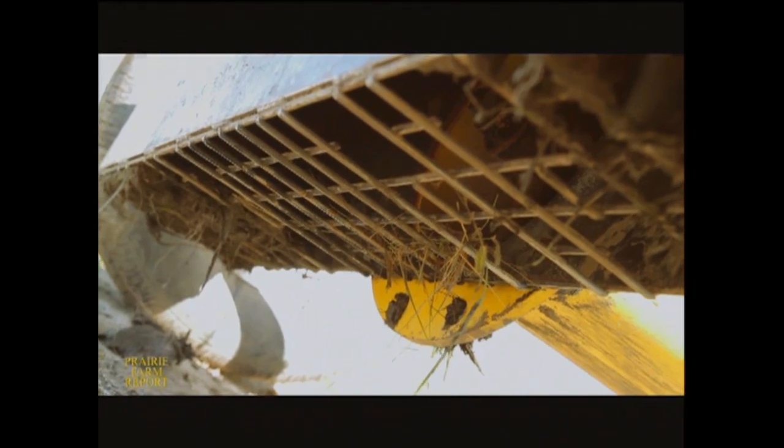The mesh underneath the bottom feeder acts as an important safety feature. It has the capability of passing at least four-inch solids, so most of the time grass and some stocks and those sort of things will pass through there. But if you back into a bunch of weeds and knock them over and start pumping, they'll suck up against the bottom — so it's something that needs to be managed. It's a big safety feature and it does keep big chunks and logs from getting stuck inside the pump.